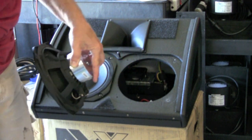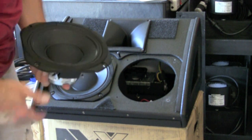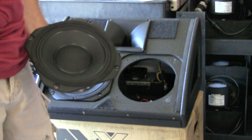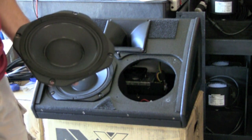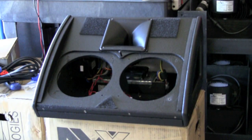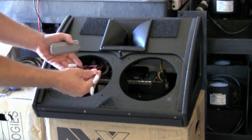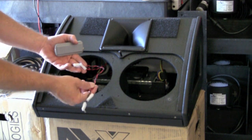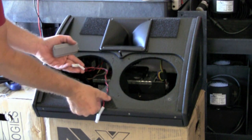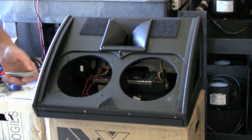What we're going to do now is pull the horn out so we can get a better picture of the inside of the cavity and take a look at the DigiPro amplifier. Pulling the drivers out, I'm noticing the pigtail on them — they are paralleled together so they're presenting a 4-ohm load to the DigiPro amplifier inside the unit. I just thought that was worth mentioning.